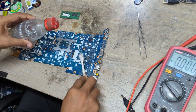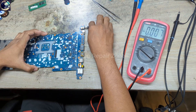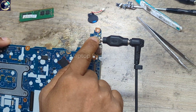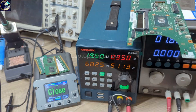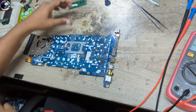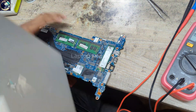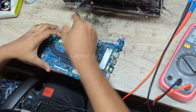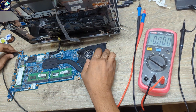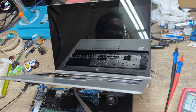Let's clean up a little bit. Now I'm plugged in again — let's check if the problem is solved. Plugged in, and as you can see the white LED goes off, and look — my power supply is taking 350 milliamps. Okay, it's turning on! Let's check the display — the display is okay. Plugged in and it's turning on.